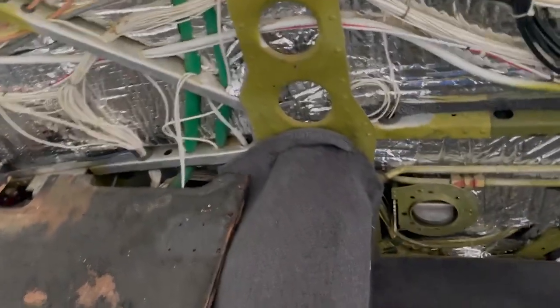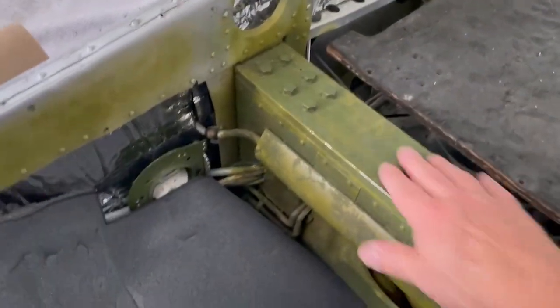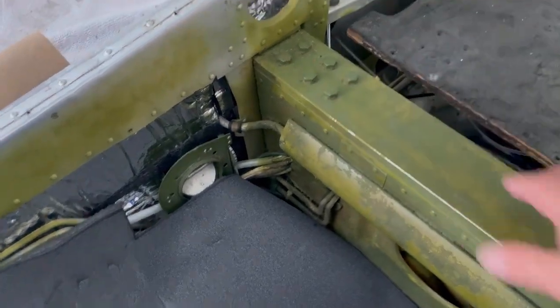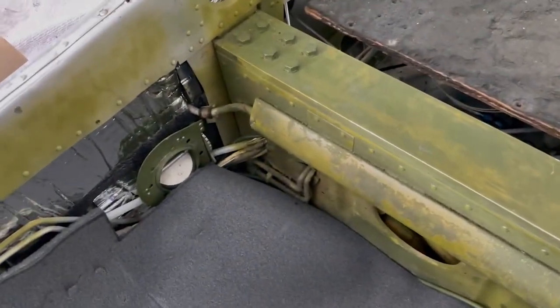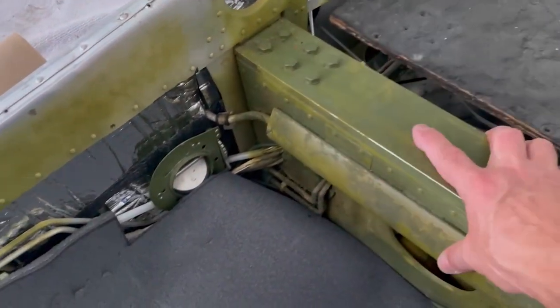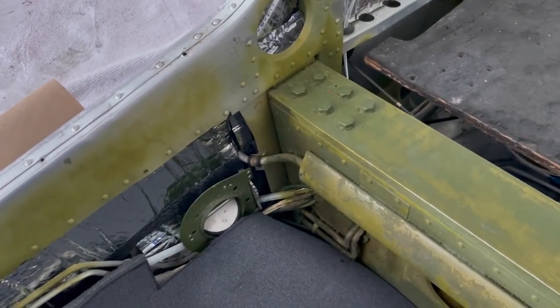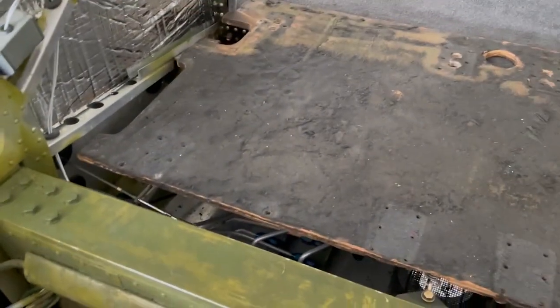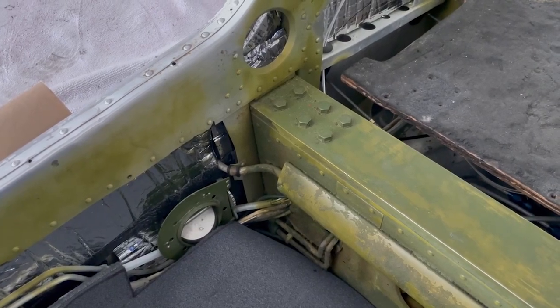Overall pretty good cut, pretty good fit. I think there'll be some minor trimming, especially along the carry-through spar. I really want to give some thought as to how I want to attach this. I wasn't too pleased when I took off the one that was on there, because these are your main wingspar bolts on the top and then there's ones on the bottom. The carpet I took off was glued down covering these and it had never been removed. I don't know when the last time during an annual inspection anybody looked at these. 1997 is when that carpet was put in — it definitely hadn't moved since then. That was a little concerning to me.